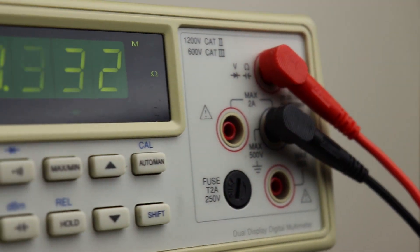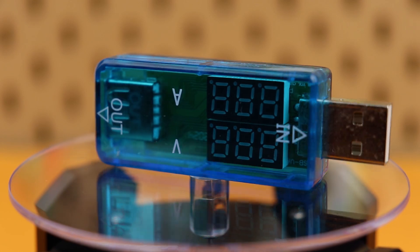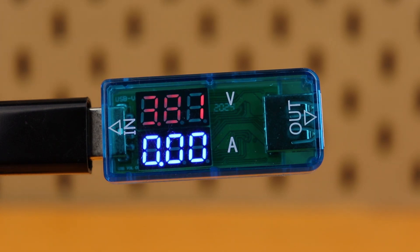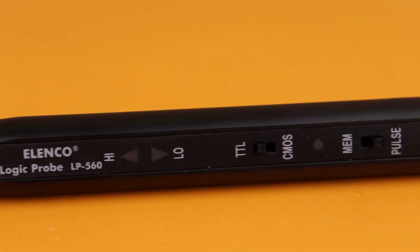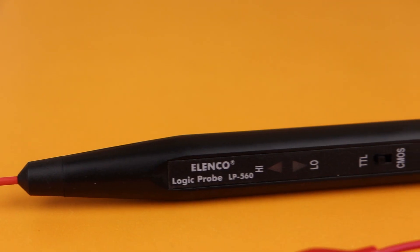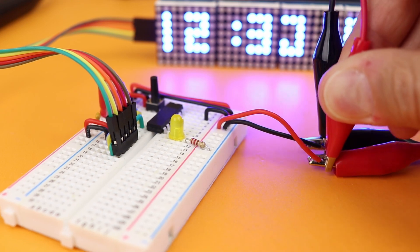In my lab I have a precision benchtop multimeter that measures voltage, current, resistance, capacitance, and a bunch of other stuff — but especially as a beginner these can be a little bit expensive. Fortunately there are very small USB-powered volt and ampere meters that measure the voltage and current that passes through them. The voltage display will always be close to 5 volts since that's the USB voltage, but measuring the total current can be quite handy. I also recommend getting one of these logic probes — especially with microcontrollers these can be a true lifesaver because it's so easy to see if there is activity on microcontroller pins or if the circuit is dead. These probes have two connections, VDD and ground, so make sure they are plugged into the power rail of the breadboard circuit you are trying to troubleshoot.